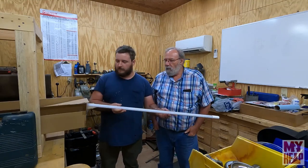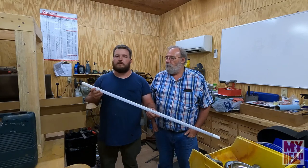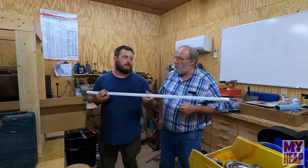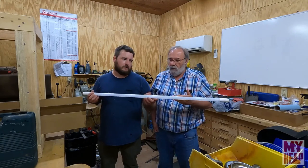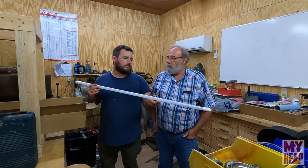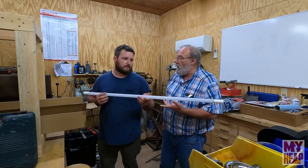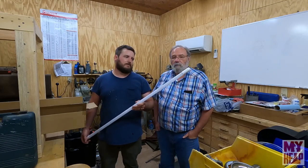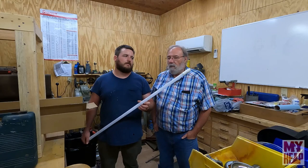These are ballast bypass LEDs. So you have a line side and neutral side. You go in, you cut your ballast out, you wire one side of the fixture to power, one side neutral, and put it in. There are two different types — this is ballast bypass, where you completely eliminate the ballast. The other type is insta-fit LEDs, where you can leave the ballast and it still works. I prefer the ballast bypass because you get rid of the ballast and they seem to be better overall. The insta-fit ones seem junky and finicky — they don't always work.